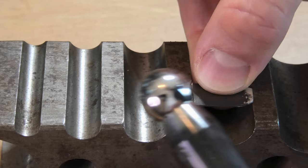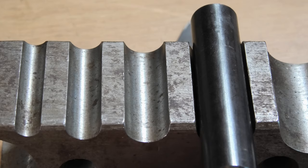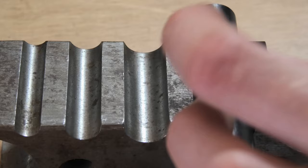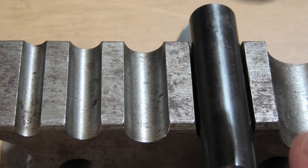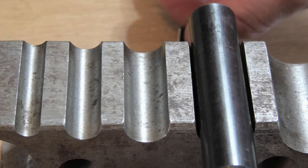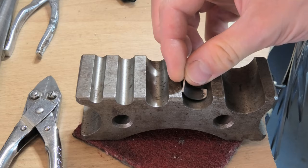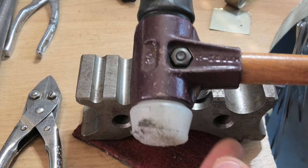Get one where it fits, then you can even start it off with pliers so it's got a bit of roundedness and drops in there more, and then tap it in. I've got a heavy nylon-ended hammer — very hard plastic with a lot of weight to it — for hitting these sorts of things down. Rawhide mallets are rubbish, throw it in the bin. Ideally you need something that isn't metal when you're banging metal against steel tools. Give it a tweak with the pliers so it drops in nicely, then use the hammer.